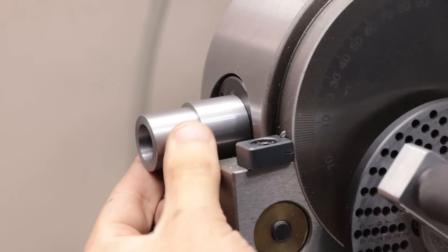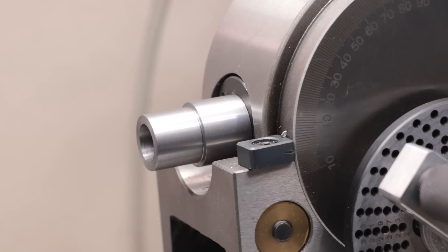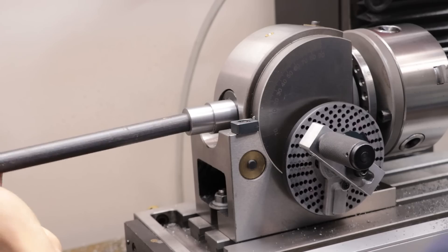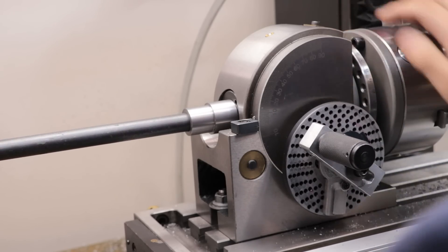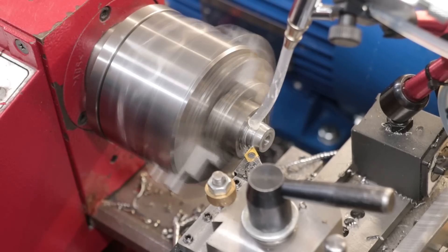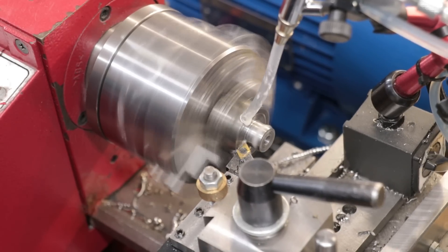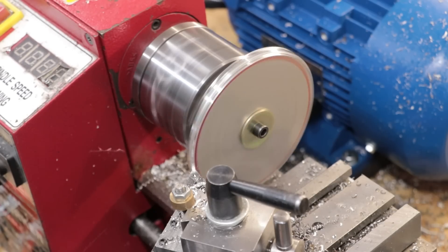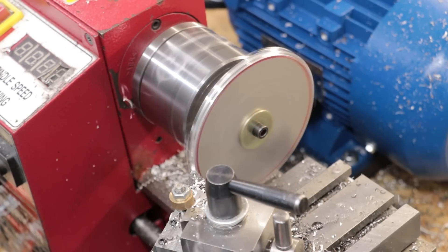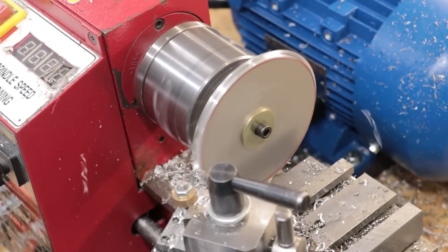Now the step down here was initially intended for a supporting bracket, but the design was a lot more rigid than expected, so it wasn't used. And to connect the gear to the mandrel, I'll feed through a shaft with the gear connected. And speaking of which, the design does call for two 45-tooth gears and two 90-tooth gears. I'll have to make those from scratch since I don't have any on hand. However, making them was a lot easier since I already have the dividing head set up.